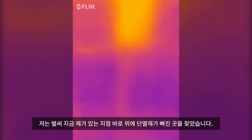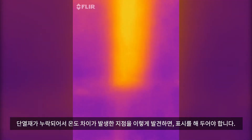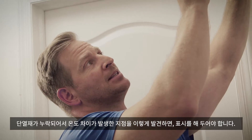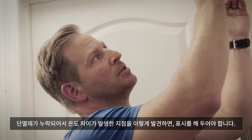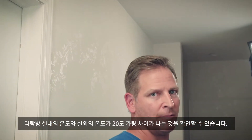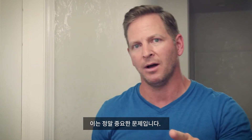It's right above me, right here. I can mark that spot because I see that there's missing insulation there — I can see the heat infiltration from upstairs. This is the attic above me, and I've got a 20-degree difference from the outside to the inside.